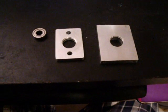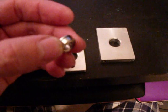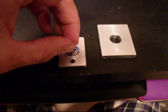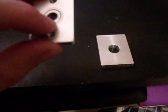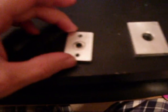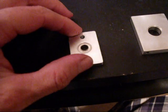Here's the upper and lower bearing holders — this is the bottom one, and this is the bearing. I chose a flanged type of bearing because it's easier to work with, and my design avoids press fitting. The flange stops it from falling through, but the bearing protrudes out by one thousandth of an inch. It'll be mounted on the bottom of the helicopter, and when the two bolt holes bolt it down, it'll hold the bearing solid — the outer race will be solid.